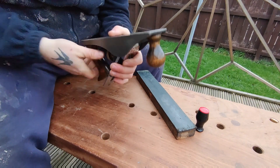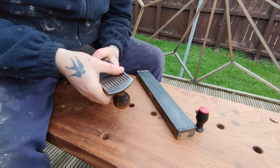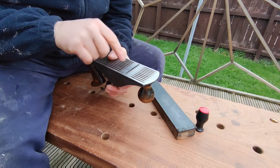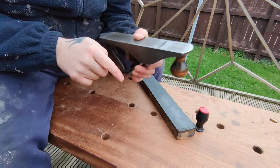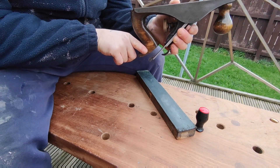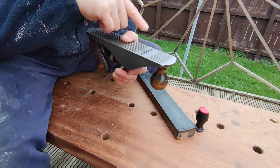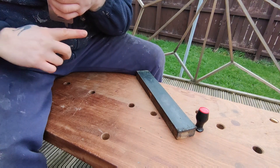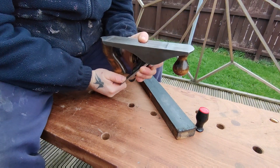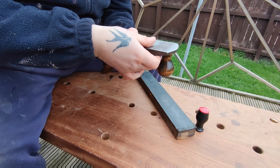A little more. I can't really feel a great deal on this side, which tells us that the blade is protruding more on this side. So with the lateral adjustment I want to be pushing it this way, because this side of the blade is protruding more. If the other side were protruding more I would push the lateral adjustment the other way. So I'm going to ever so slightly adjust it — that doesn't feel too bad.